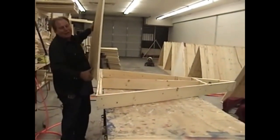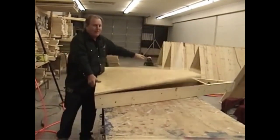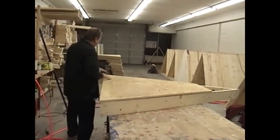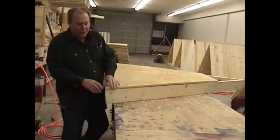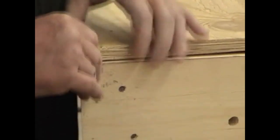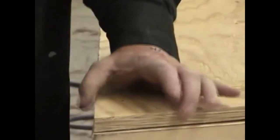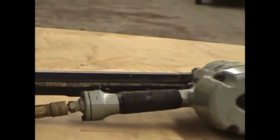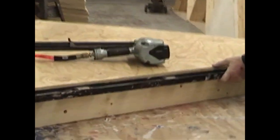For those of you that are do-it-yourselfers, when you're going to put the plywood to the carcass, if it doesn't fit, you've done something wrong somewhere. Your fingers will always tell you better than your eyes a lot of times. What I like to do is just get this spaced evenly from one side to the other. You can feel that. I know this side is good because I checked it with a straight edge. Now I'm going to tack this.